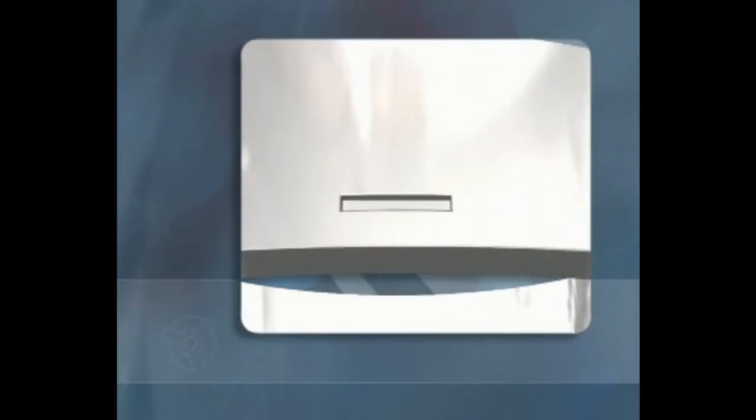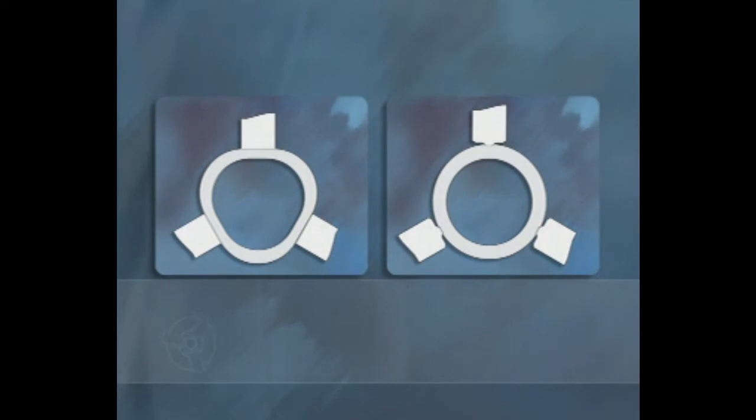And how does it work? Quite simply, with a small indentation on the workpiece. This creates a keyed fit between the clamping jaw and the workpiece, which is far superior to the normal force fit. Only a fraction of the clamping force of traditional methods is needed. Time-consuming and costly rework and correction due to deformation are much less frequent, and the accuracy of the final product is superbly impressive.